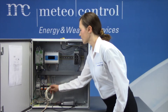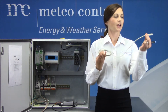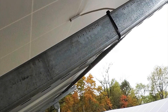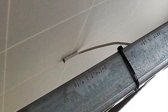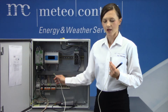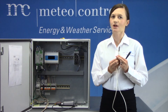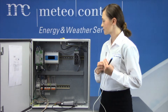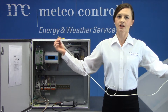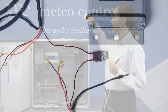First I'm going to show you how to wire a temperature sensor. This sensor is a module temperature sensor and is installed on the back of the module to measure module temperature. This is an analog type of sensor and it will be connected to an analog terminal block. This type of sensor cannot be daisy chained or connected with other devices — it has to be connected individually to a separate channel.